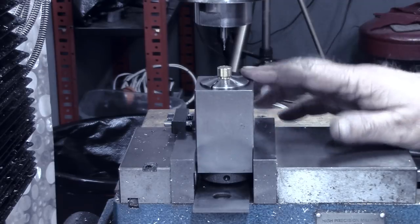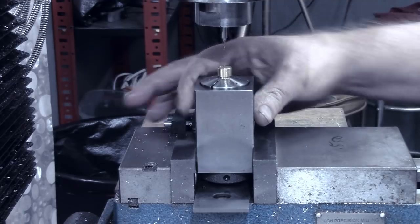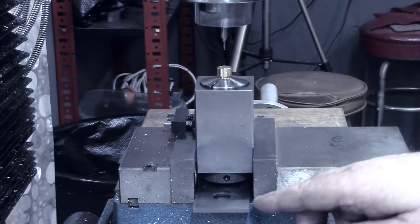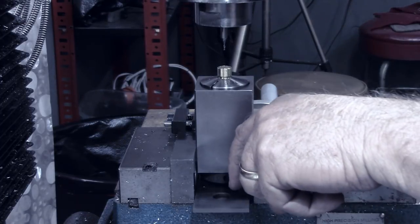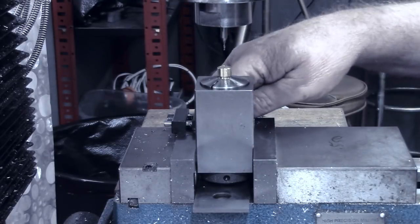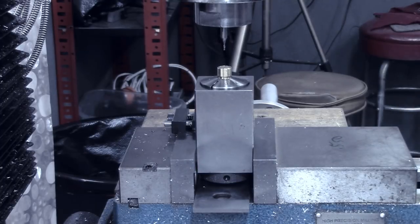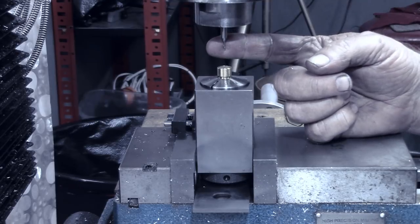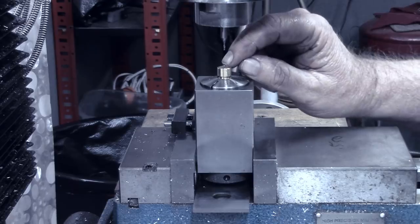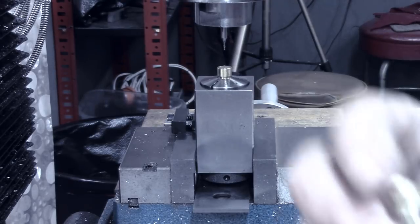Okay, I'm back over in the mill now. I've got my 7/16 collet in the square collet block, setting down on a wide parallel. I have checked that it sets plumb when it's setting down on the bottom of the collet, that the end of the collet is square as well. I have a 1/16 inch end mill in there now, and we're gonna lay out four holes in there just to simulate the holes that would be in a button to sew it onto something.